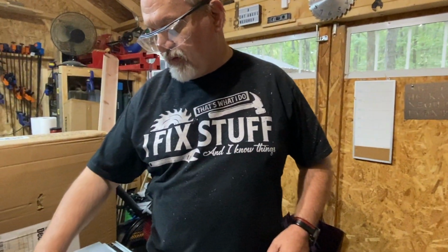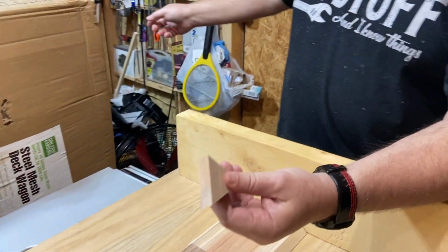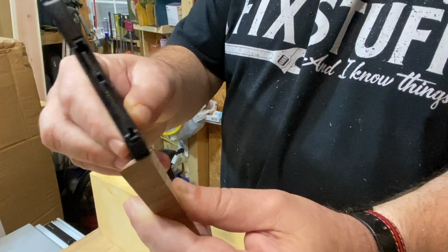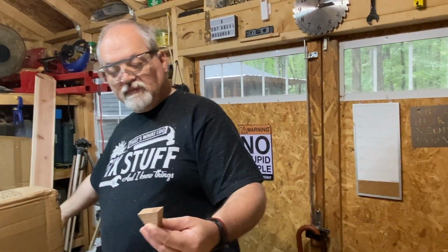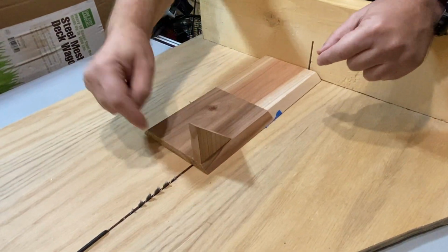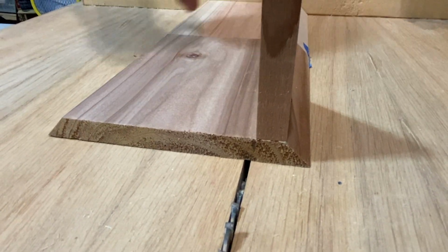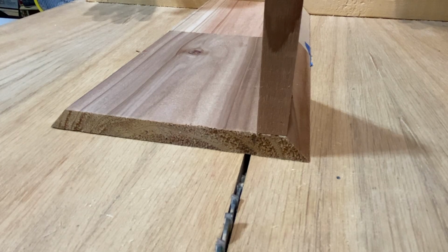So we'll put another one here to reinforce so it doesn't move. We found this piece of wood that we're going to use as our spacer, and it gives us a nice, comfortable fit for our drive, right? We do not want it very snug here because we want air to move through the drive to cool it. We do not want it to be so tight that it fails because the drives don't get cooled. Make sense? So since we decided this is our thickness, we are just aligning it here and we made a mark. And now all we're going to have to do is turn it over because we need to run dados on these sides, right? We're going to turn it over and start making our cuts.